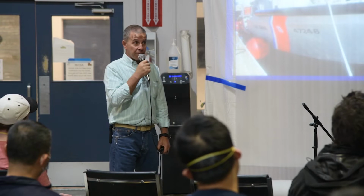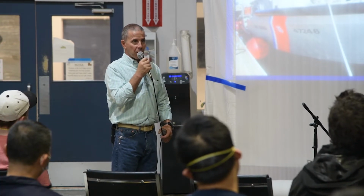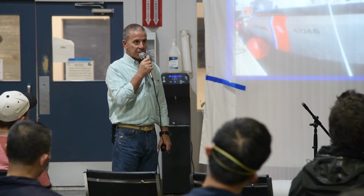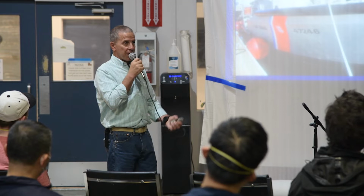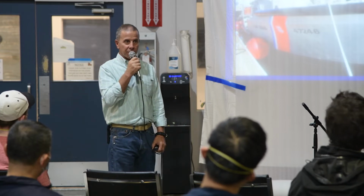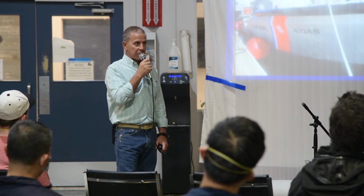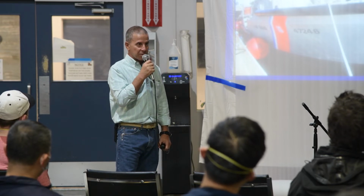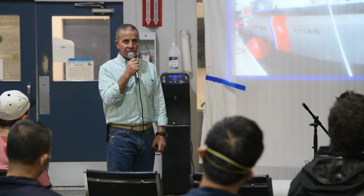protection, you really aren't. Aluminum on its own, from what we call simple corrosion, meaning it's not in contact with other metals, is pretty low. You see aircraft that are silver, they're not painted. Plenty of commercial vessels, workboats, and things of that sort, even some military vessels, are just unpainted aluminum. That is the preferred approach.